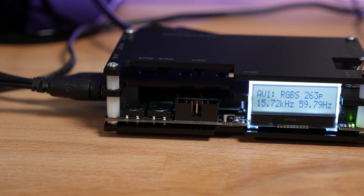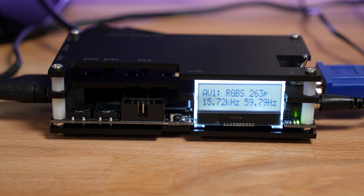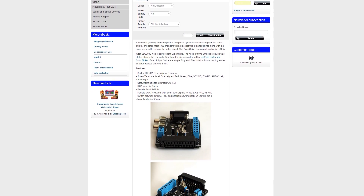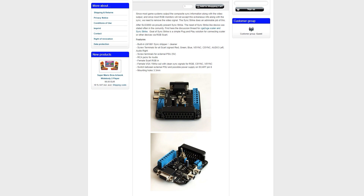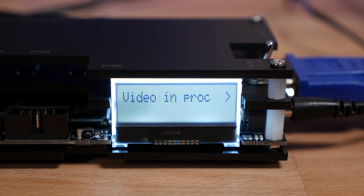While you can plug composite, S-video, and component directly into the StarTech, for RGB stuff I typically use my OSSC. You can do true 240p capture of RGB sources using something like a sync strike to interface to the StarTech, however I don't have one on hand to demonstrate. So on my OSSC, I keep it pretty simple — I use 4x scaling, which on a 240p source gives me 1280x960 resolution, and I make sure to keep the scanlines turned off. I find the stock settings with 4x scaling and no scanlines work pretty good.